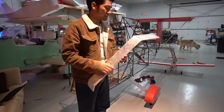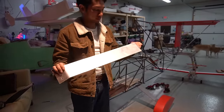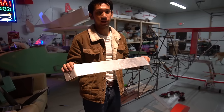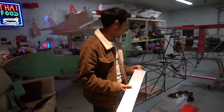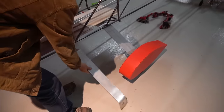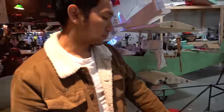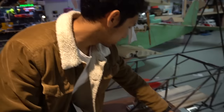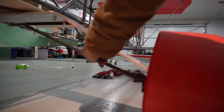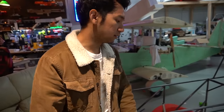What happens is one of the landing gears simply folded under the airplane, it just fell over on its side. Now this is quarter inch 6061 aluminum. That's pretty long, and it has really stupid long landing gear. I really should have adjusted that before trying to fly it. But anyway, that landing gear is much shorter on this current airplane, and that's a 3/8 inch thicker aluminum. And I've yet to put the spreader bars in it, because I'm going to put one spreader bar to one side and one to the other side, so that this thing can't actually compress in a side load if I were to get it in a ground loop condition. So that should be nearly impossible.